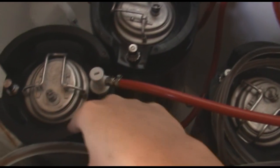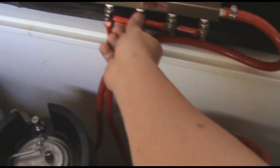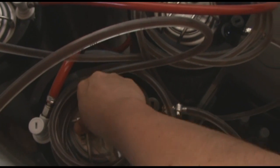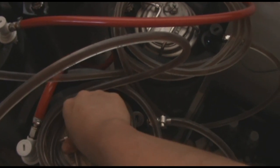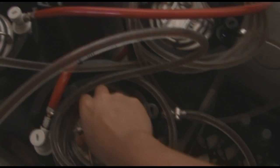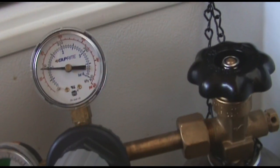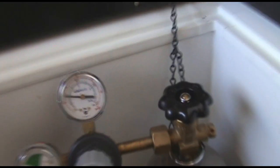What I'm going to do is turn off the CO2 so I can just mess with this keg alone, which is the beer that I'm pouring right now. Really, all I have to do is just release pressure. As I release pressure, I can look over at my gauge and see where it's at. It looks like it wasn't really too overly carbonated, but it's probably just a little bit slightly overcarbonated.